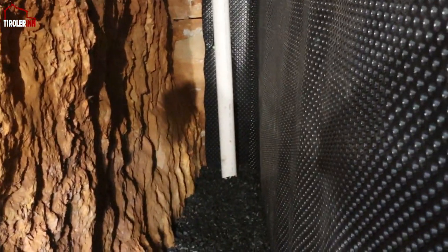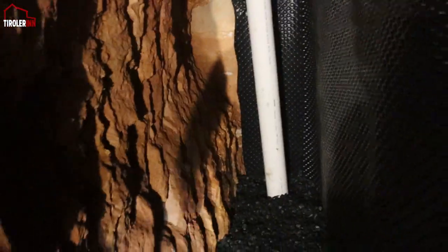I have attached a pipe that is vertically up here — I have a piece that goes on the top to just close it, but this allows me in the future if I ever needed to extend it, or if I need to clean it out, I can just put a snake in here and snake the entire area and clean out the pipe.